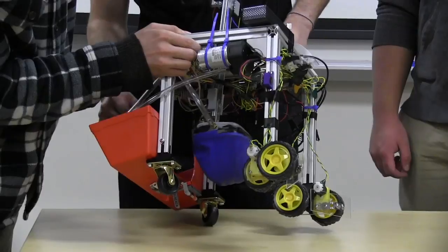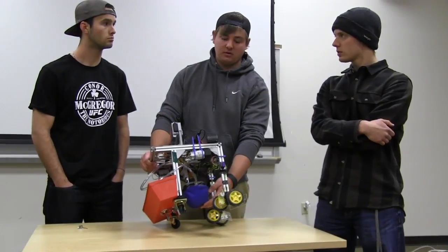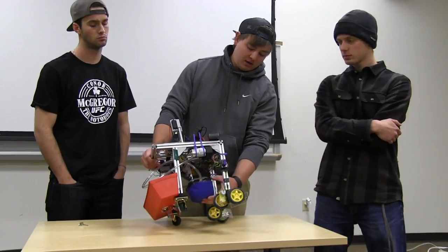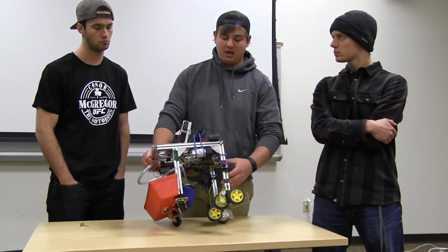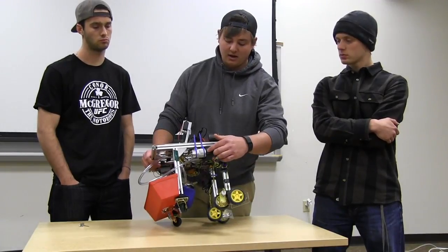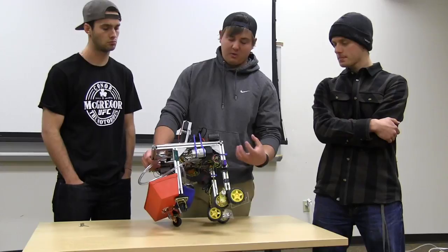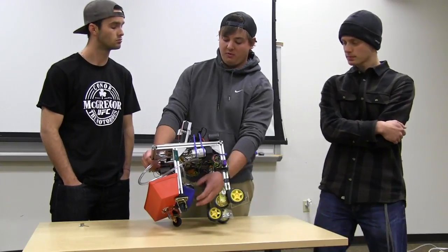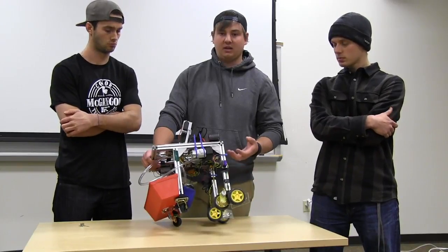The gripper assembly is down on the bottom here. The gripper is made out of a small homemade container, and it's full of coffee grounds. When the gripper is pressed down over an object, the coffee grounds surround the object, and then the air is sucked out of the balloon by this vacuum pump, and that compacts the coffee grounds together so that they can't move past each other.